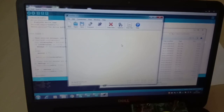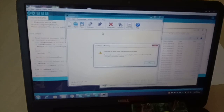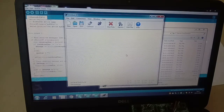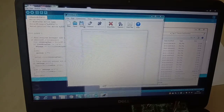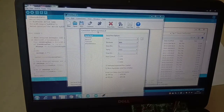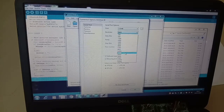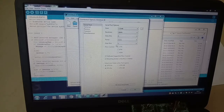Once it is connected, you can try to connect. It doesn't find the terminal automatically, so go to Connection, then Options, and then scan for the terminal — it will find it. The baud rate should be 38400, which is the default for the Bluetooth module. Data bits, parity, and stop bits are already okay.